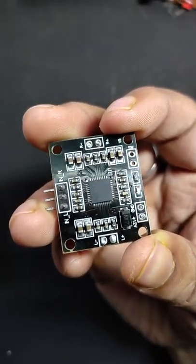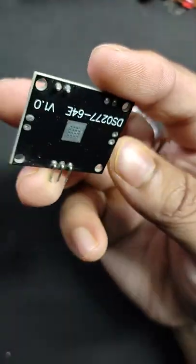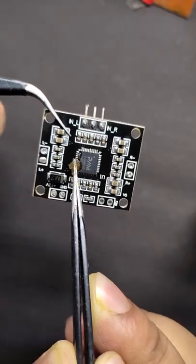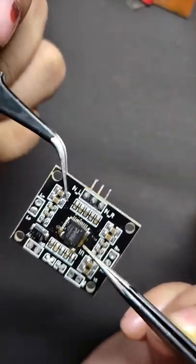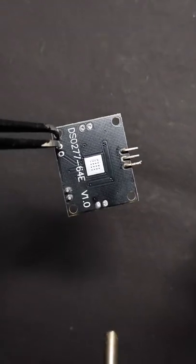It's a very popular audio amplifier chip in a 40-pin QFN package, and here I'm going to desolder it with a hot air soldering gun. Apply some solder paste on the solder joints of the IC, and heat the bottom side of the PCB with the hot air soldering iron.